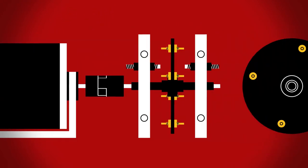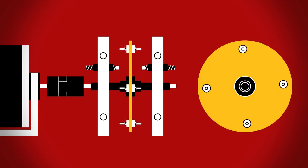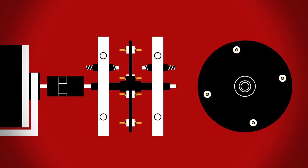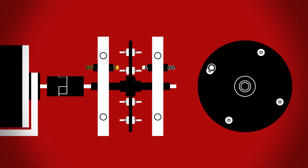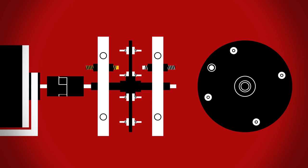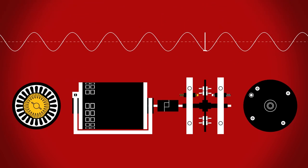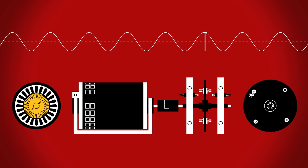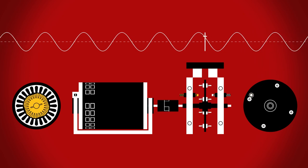Because of that, we can put electrodes on a rotor here, and we have a set of little metal pins on a spinning insulator disc. These are made of tungsten. And when these pins come to alignment with these stationary electrodes that you can see poking out the sides here, electricity can jump across from here to here through this. So now the switch is closed, and once it pulls away, the switch is open. We need the timings of the opening and closing to be very, very precise, and we need those timings to be locked to the AC waveform. But in doing that, we're throwing sparks in there, which makes things get really hot. So we like to let it breathe a little bit.